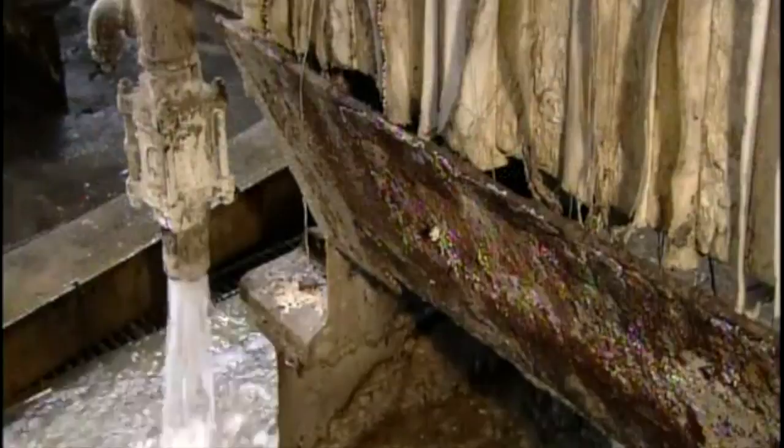A water circulation system flushes the silver-rich powder out of the cylinder and into large tanks, which keep the water moving. To separate and dissolve the metals the powder contains, workers pour in acid. The solution containing dissolved silver is then pumped through filter presses.